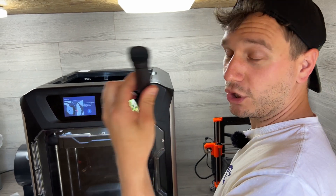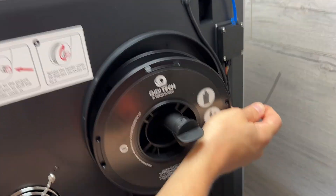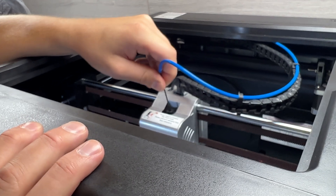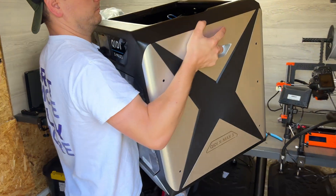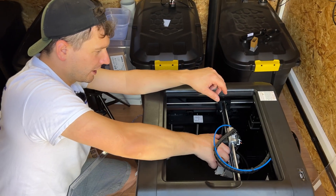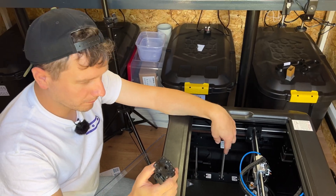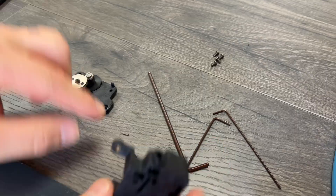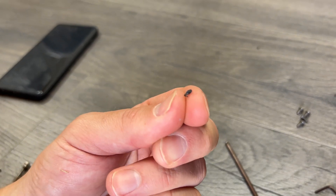This is exhibit number one of what I mean by my filament rant. Have a look in there — is it extruded? I don't know what's going on there. It's jammed. That is actually surprisingly easy to take out — really easy. It's literally front cover off, drop the hot end, extruder. Looks like something that must have been left in testing: a big juicy lump of melted filament.